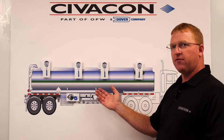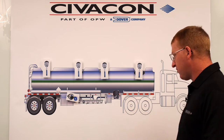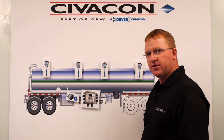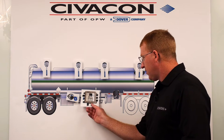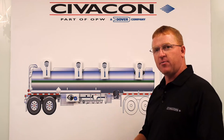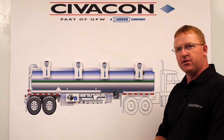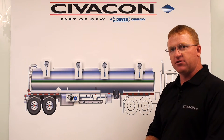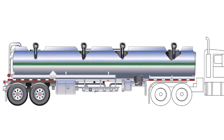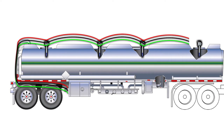Notice on the system we're working with here — the 5-wire system — there's no onboard monitor on this like in the 2-wire. On a 2-wire, you typically have an onboard monitor that helps you troubleshoot the system and the faults. On the typical 5-wire like we're dealing with now, it only has a blue socket or the optic socket. The only way to effectively troubleshoot this is with some sort of tester like the one we showed in the film. The way that a 5-wire system is wired is the red, black, and green wires are all wired in parallel.